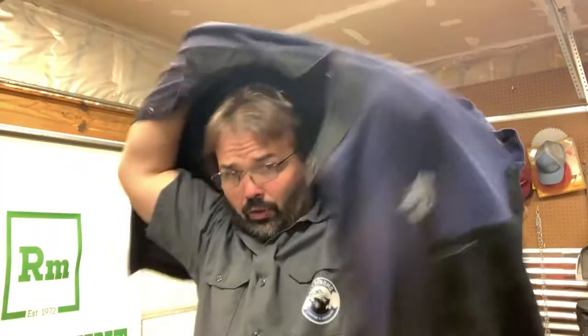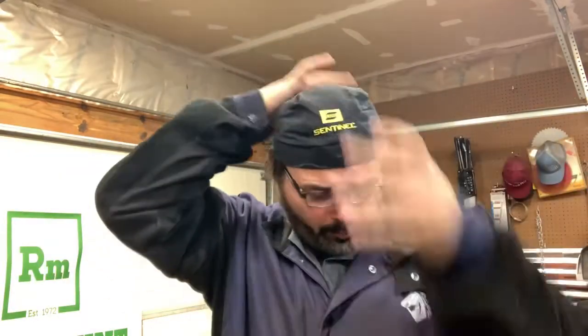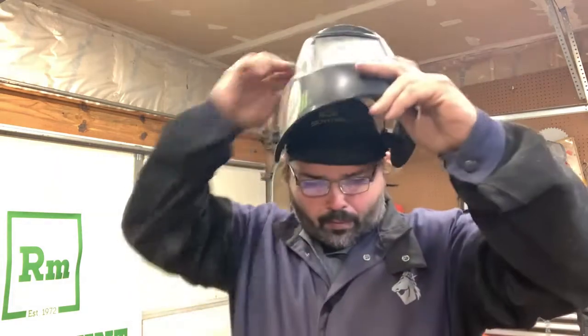We're going to gear up here real quick. With flux core there's a lot more spatter, so always be somewhere prepared — even if you're out in the field, if you're laying underneath your rig and you have to weld, you want to be covered up. Typically inside I'll wear a respirator; obviously in the field you probably won't. I do pack a pair of readers because there's nothing wrong with being able to see. I'd suggest some kind of FR cover, and as I get older hair is more important — you will need a helmet.